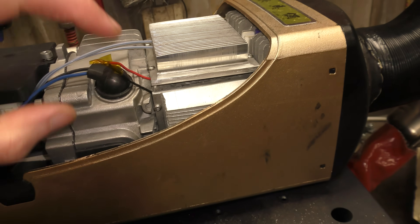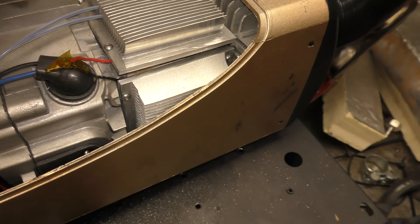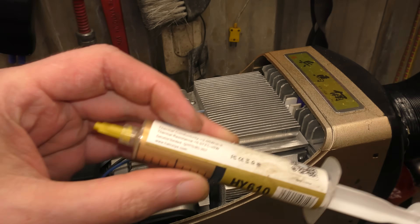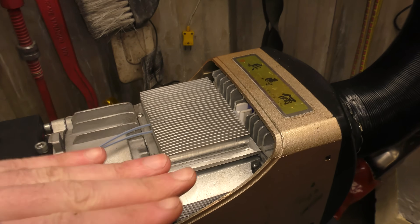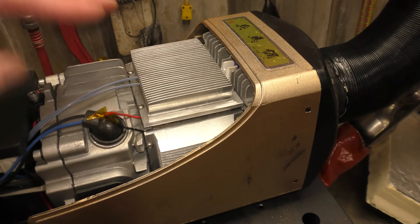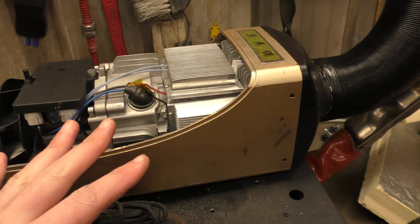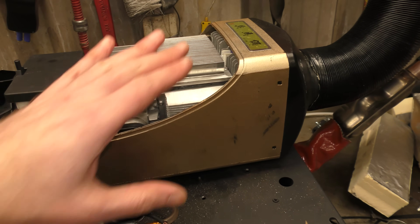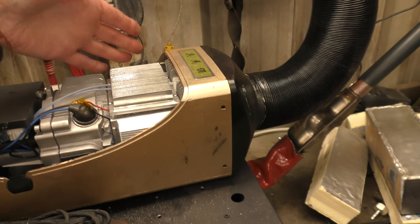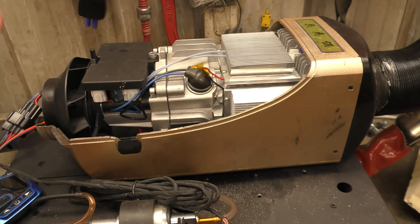So the machined flat sides have three 60mm square TEG modules mounted onto them. I've used copper-based thermal heat paste to go in between the TEG, the heat exchanger, the TEG and then the cooling fins on top. So basically the inside gets really, really hot from the burn chamber and then the cool side is cooled by the air passing through the diesel heater body, heating up and then leaving through the usual heating route. So we're not adding any bulk to the system.